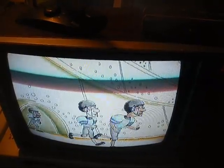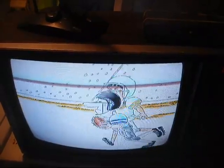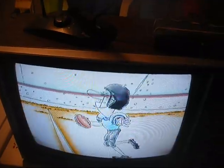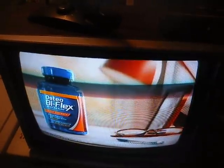So what this thing basically needed was just a little time for the picture tube to wake up and some adjustments, and then we replaced some critical capacitors that have been known to cause trouble and resoldered some questionable solder connections, and this TV appears to be good to go. Now, how long it'll last is anybody's guess. It may go 5 minutes, it may go 5 years, but that's the only thing about selling something like this, because so many people today have the Walmart mentality.